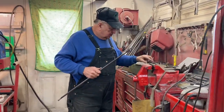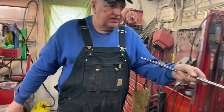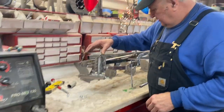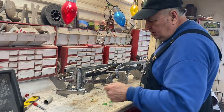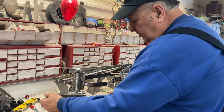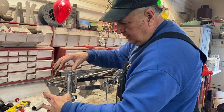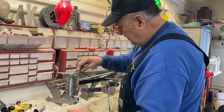Let's back up and show the progress on the plow. Today I worked on the front steering hitch. I got a wheel too - I'll show you that. This is how it all has to go. These two pins here are just temporary; I'm going to put in two different ones, a little bit bigger. Here's what happens when the tractor is on the three-point hitch and it turns - all this linkage moves.